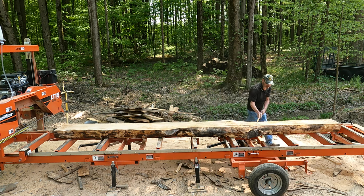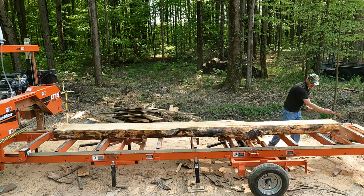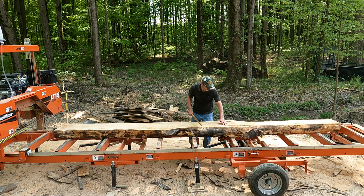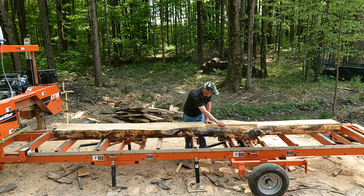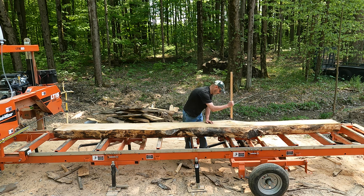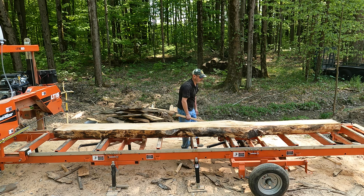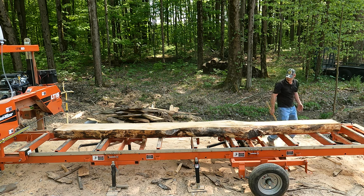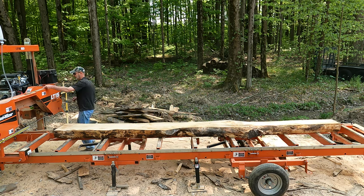I don't know. I hope that doesn't get any worse further down in this log. I kind of think I got to go another half inch or so just to get rid of these, because they're both going to be in the log. That doesn't sound good. That sounds like it gets hollow as you go further down. What to do. I'm going to take another inch off this side, shave it down just a little more.